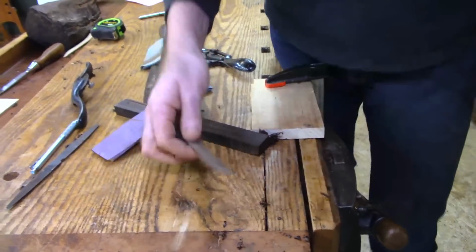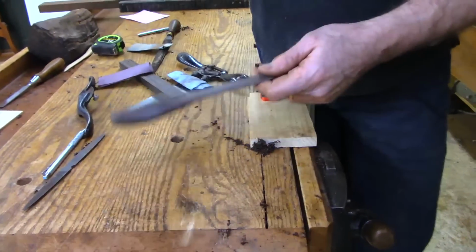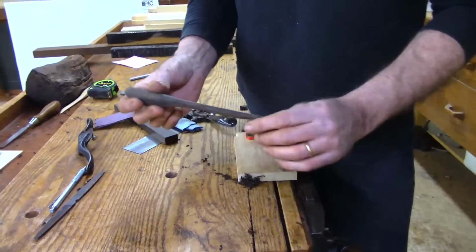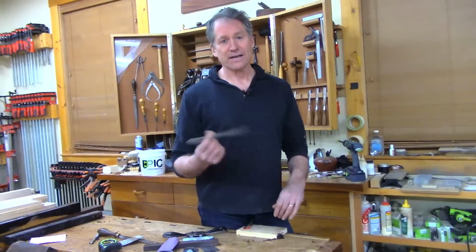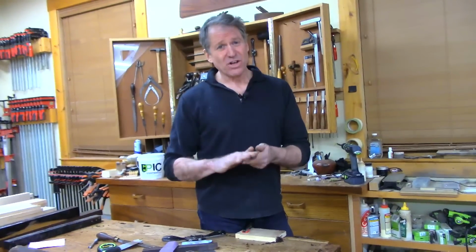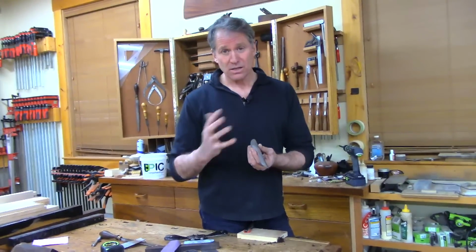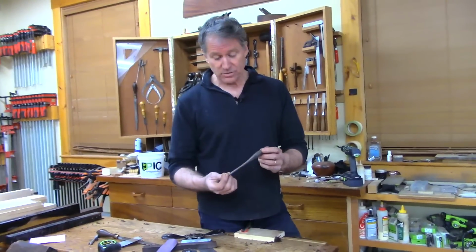And then now to finish it, some oil finishes do not actually respond well to oily woods like this. Teak is an oily wood as well and can present some problems. One of the things is, lacquers have a real hard time adhering to this. It's also, from what I'm reading, due to the silicas in the wood as well as the oils, but I personally think it's more of a factor of oils.